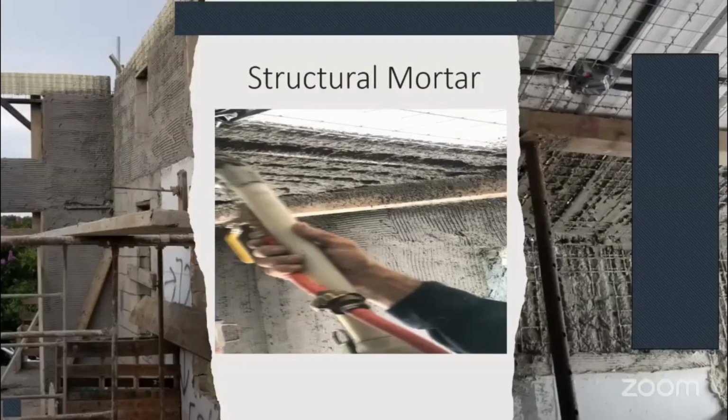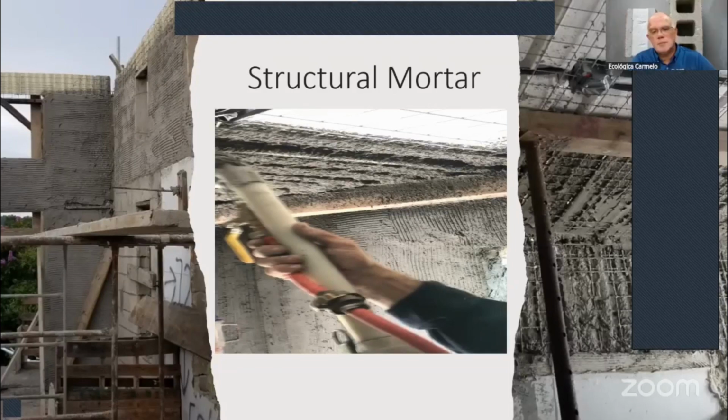So you can't even add, like you were talking about, a silicone-based or latex-based stucco with your additive? That won't stick either, because again, it's hydrophobic, so it's going to be hard to stick on it. So if I go with that, I'm just going to be stuck with a concrete finish, which I'm okay with. I like the look of concrete anyways, but I never considered that. That's something new.